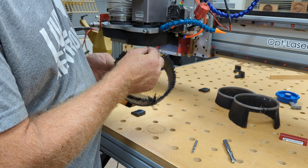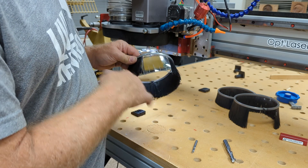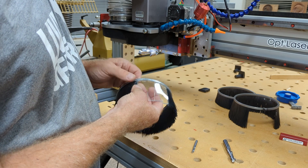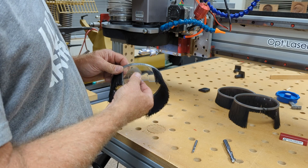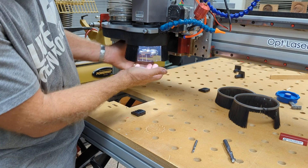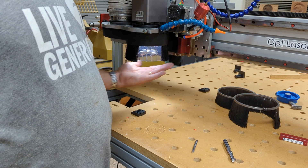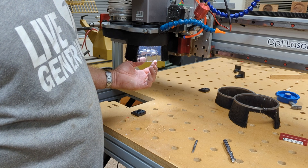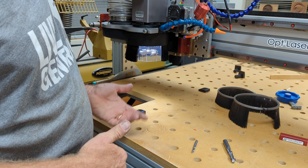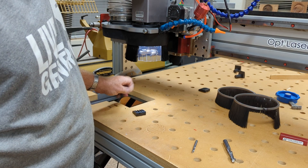What I did was spread the crimp on the metal band that holds the bristles and instead of bristles I cut those out with a side cutter — kudos to Avid, these are some really tough bristles, you literally have to use a side cutter, they cut almost like copper wire. I loosen the crimp and put in this piece of material — it's about 2 to 3 millimeters thick, kind of like rubber placemat material, the really heavy clear kind you see on tabletops. I bought it off Amazon — I'll try to find the link. It's flexible and clear so I can still see through there, but it's flexible enough to keep wood chips bouncing off inside and prevent them from shooting out the side.